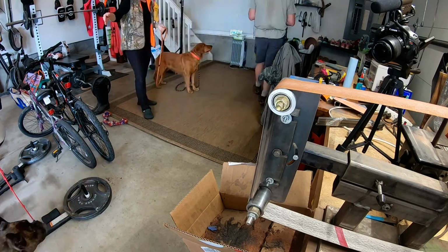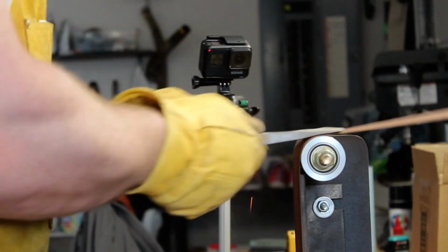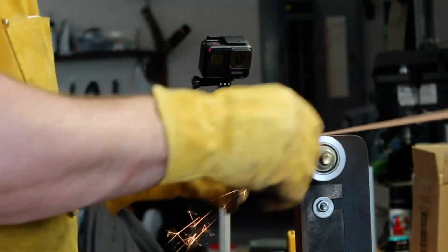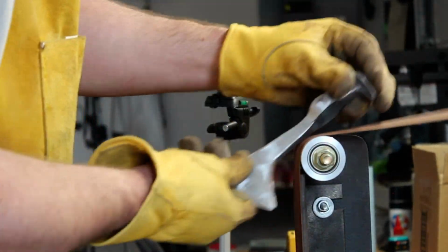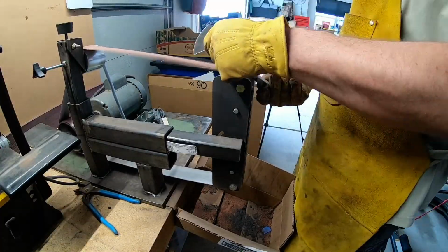With angle grinding complete, now we move over to the belt grinder, and now we're not only shaping the top and bottom of the tomahawk, but we're also shaping the sides of it. So again, still in that rough grinding shape, we've not done any heat treat or anything, but now we can really start working that shape in using the belt grinder.